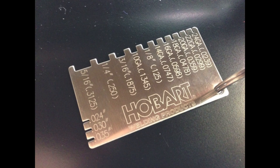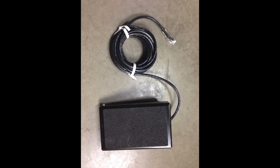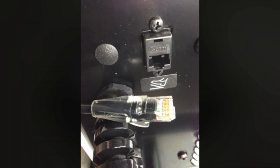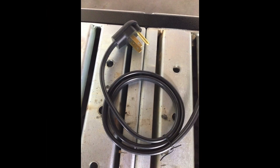I checked the metal thickness with the cool gauge that comes with the machine. I connected the air-cooled TIG torch and connected the work lead using the work clamp to the table. I took the foot control and connected it to the front of the machine using the Cat5 cable connector. I also used the Smith regulator and hose, connected that to the rear of the machine, and then finally plugged it into the receptacle on the wall.